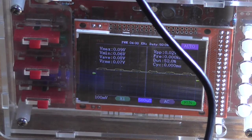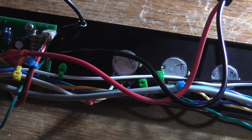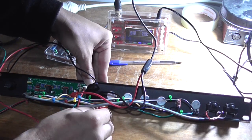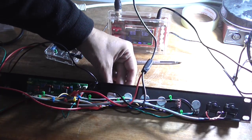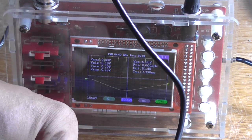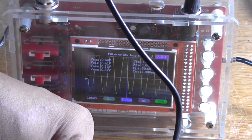So, before I go any further, I'm going to directly inject the signal into the M1 position, which is the top end of the potentiometer, and make sure that at least the output buffer stage is working. Directly into the pot, if I can. Wow, that's very interesting. The pot is fully anti-clockwise. Yeah, that really does a lot.